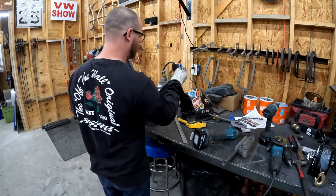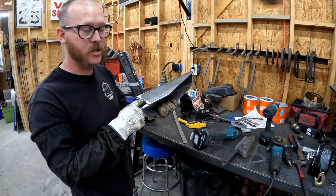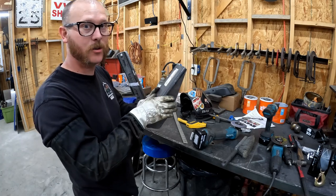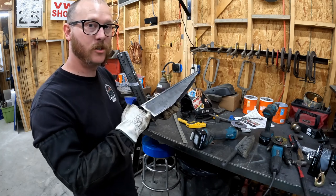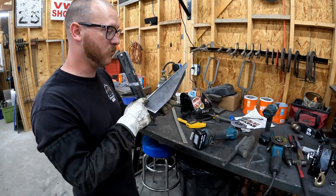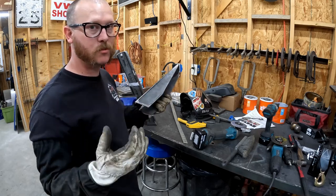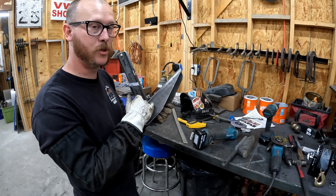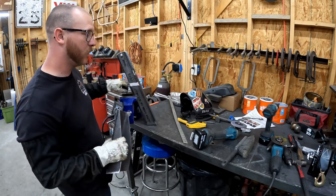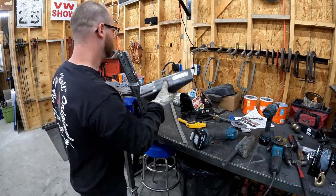And then we'll go ahead and start burning some of this stuff in. Okay, got everything all cleaned up. Pro tip, if you are welding on hot formed material like this that has a mill scale coating, you have to grind off that mill scale coating. Your MIG welds will not fuse through the mill scale. They'll wet out beautifully, but they'll be super brittle. They'll pop right loose. You just cannot get a MIG weld to fuse through that mill scale layer. So that's why I've gone around and ground off all of the mill scale anywhere I've got to do a weld.